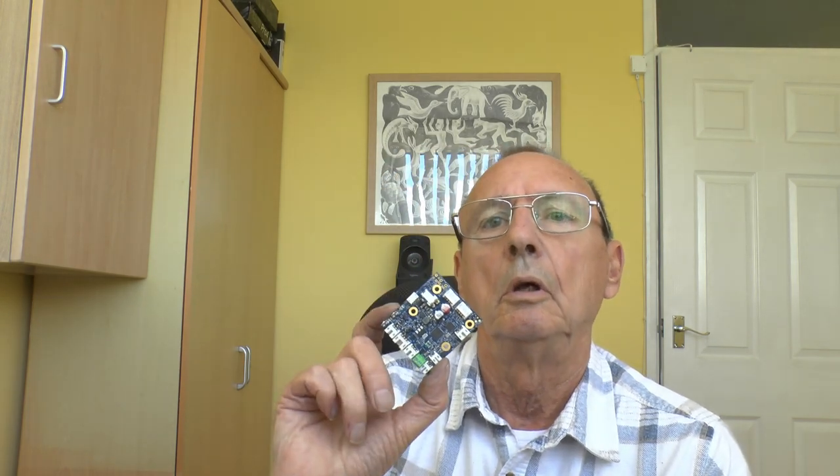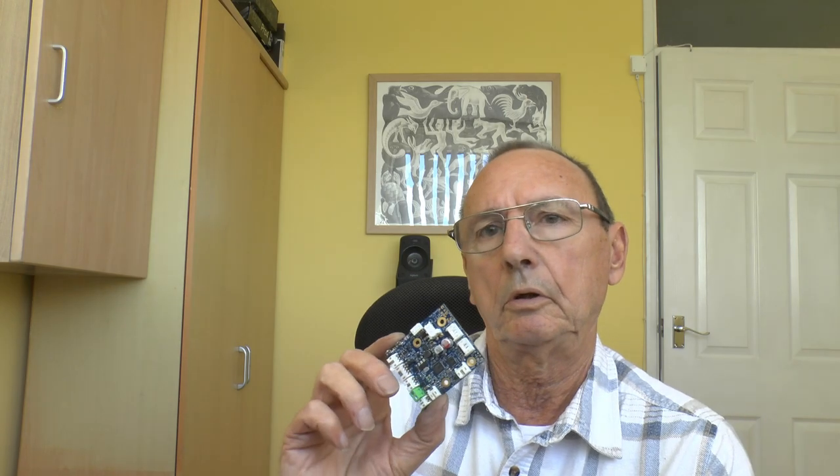Although I'm planning on enclosing the printer, mostly because of these electronics, I'm not planning on going to silly high temperatures. I probably won't go above 50°C in the chamber, just to protect the electronics — the hotter you go, the shorter the life of any electronic component. I'm trying to avoid any kind of cable chain if I can.